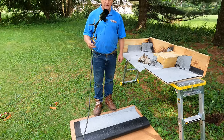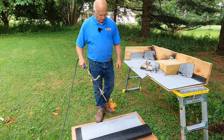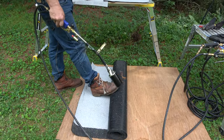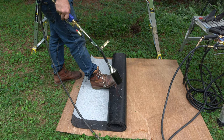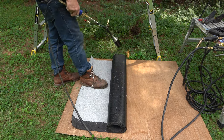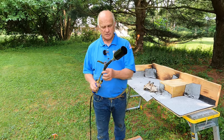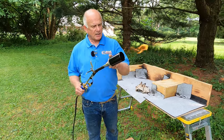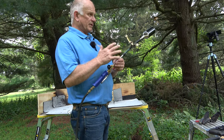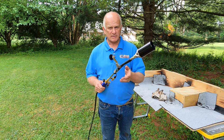I like the output — it has a lot of BTU output. It's a nice length for me because I'm five foot eight and it reaches the roll right where I torch. I can kick it while I'm torching. It's the right length. The only disadvantage is you've got to modify it. This is heavy — much heavier than the other torches meant for roofing. This is not meant for roofing. Harbor Freight sells it for killing weeds and all kinds of stuff.